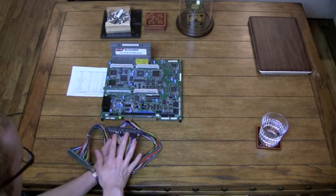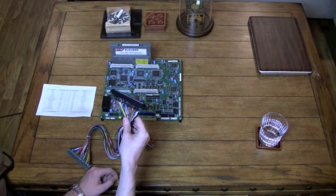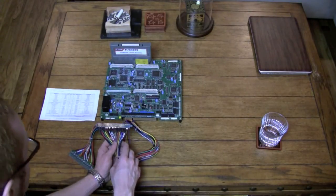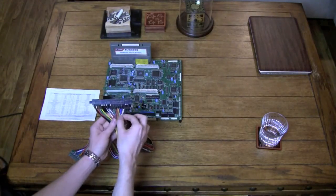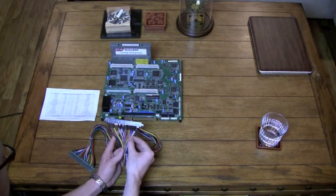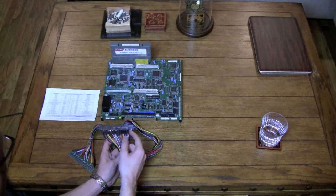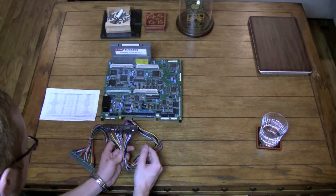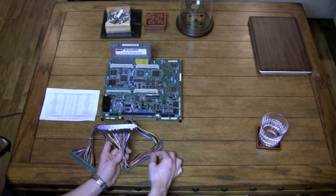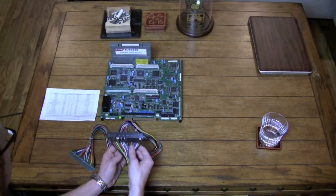If you want to hook up a 6-button cab, something a lot of people don't know, which is actually on this little list here, is you can wire your 6 buttons through here. You don't have to use a kick harness. The way you do that is you put button 4 on 25, which this one already has a little white wire on pin 25, and you can use this for your Neo Geo too. This is really common. You can just go ahead and put a fourth button in. Button 5 you can put on 26, which is this guy here, and then button 6 you can put on pin 11, which would be 7, 8, 9, 10, 11, this blank one right here. So that's what I've done in my cab. It didn't work 100%, but that's a good option if you want to do it that way.